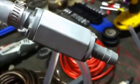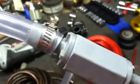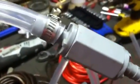This is dual inlet, dual output, and here's the bubbler reservoir combination. There's actually a clear tube inside there that's stuffed with steel wool. That's the scrubber part. The outside is just the reservoir. In some other videos you might have seen when I had the vapor or condensation trail coming out, even at 100 degrees, 90 degrees. This check valve stops all that. That will keep your electrolyte back in here and make it stronger, and so maybe you just have to add distilled water instead of putting a lot of KOH in it. And I think it's a 1-pound check valve. So that's about what we're doing now.